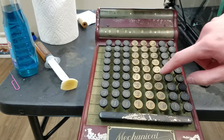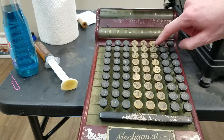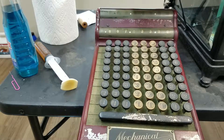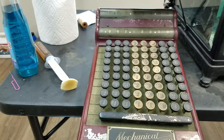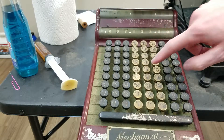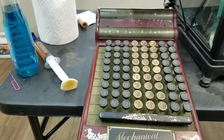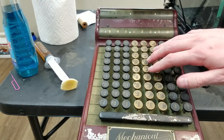This machine has the complements printed — you can see the small digits are the complements, so hopefully this will make it a little bit clearer. As you can see, the complement of 9 is 0, the complement of 8 is 1, and the complement of 5 is 4, and the complement of 4 is 5. So we would want to enter the complement of 1 less than the number we're subtracting. Since we want to subtract 5, we enter the complement of 4, because 4 is 1 less than 5. The complement of 4 is 5. This would be much easier if the Burroughs machine had complements printed on the keys, but it doesn't, so you have to do it mentally, or use this as a reference.